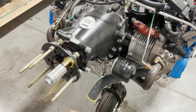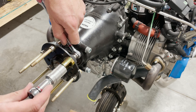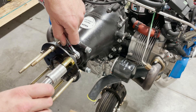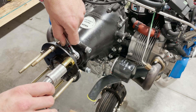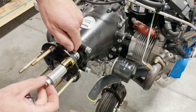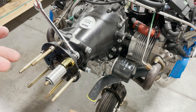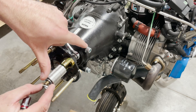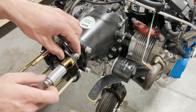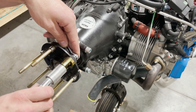When tightening these through, the best approach is to turn only the nut — you don't need to turn the bolt. Gently tightening will pull it through, and then you'll hit a stop because your AN bolt has run out of threads. As long as you're careful and slow, it's not going to damage the bolt. Then add two more washers, reinsert the nut, and complete the pull-through on the lug.